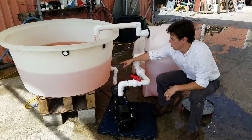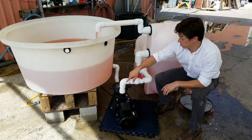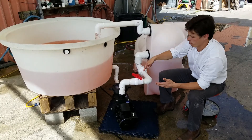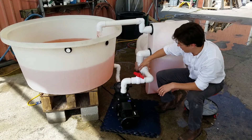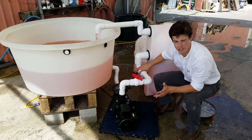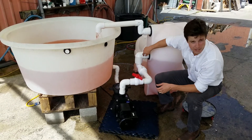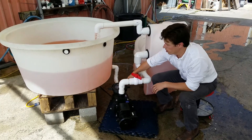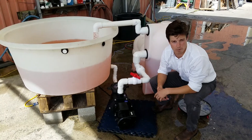Standard water pump pulling from the pond or tank, pushing through — water's coming in here and out here. Very important on your plumbing to have a ball valve and a check valve, or a one-way swing check valve, so that if you ever shut your pump off, you won't have water and beads wanting to run backwards inside of your pump. So just like last time, we dyed this water with a red food coloring for illustrative purposes.